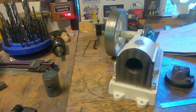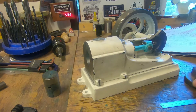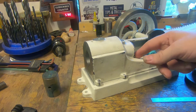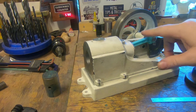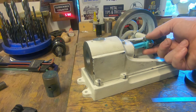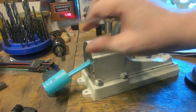If we have a look, this sort of fits. We don't know if it's flexible enough — actually it's flexible enough that we don't even have to take any of that off. That way up it actually spins, which is great. With the brass one, because I've taken a little bit off the end here, I'm probably going to set this up in the mill and machine a groove in the bottom here — just to give us enough clearance with, say, a two and a half inch cut — so that this doesn't touch. Probably also when the drip oiler drips a bit of oil it'll splash it — that's probably what's going to happen there.